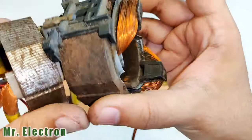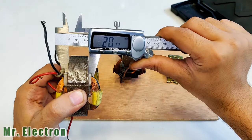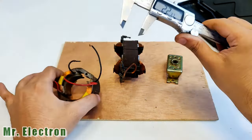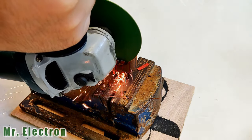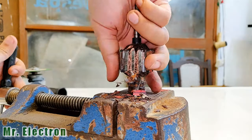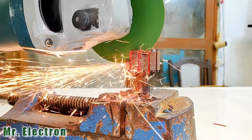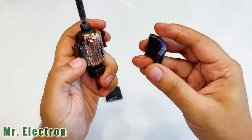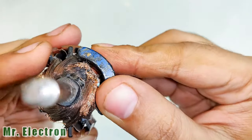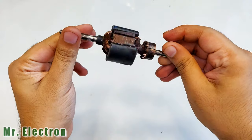The only difference is the core thickness — twenty-six point two mm for that one, and this one is twenty mm. Now, this was the armature of that universal motor from a mixer and I have chipped away these two sides to place the magnets. I am going to use the perfect concave magnets — you see how it fits over here, and same for the other one.